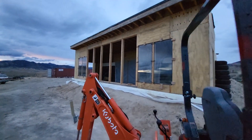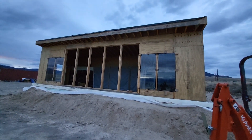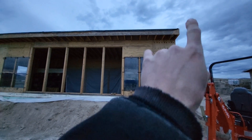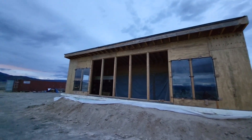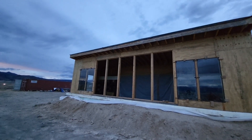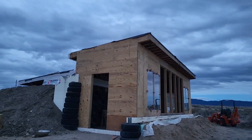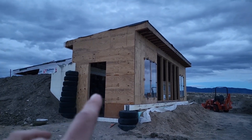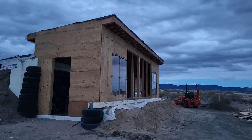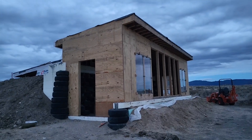This is a pretty quick trip out here and this is how it's going to sit for a little bit. I just got some quotes for spray foam as well as a standing seam roof, so hopefully that'll be coming up in the next few videos. Unfortunately all that ice and water shield I put on is not going to work for the standing seam roof, so I'll need to put another underlayment on there rated for high temp metal roofing. Next time out here hopefully we'll be getting all that prepped for the roof, and maybe even get the doors on — I've got the doors already but they need jambs made. We'll probably plastic off the front and hopefully this thing will start functioning once we get spray foam in.